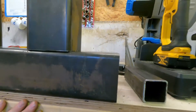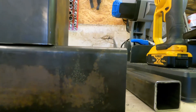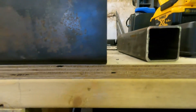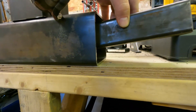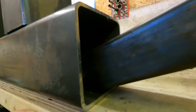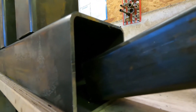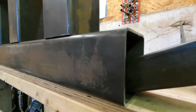What I'm thinking of doing is chamfering the corners off on this, and even opening up on the top — not to that line but somewhere — and the same on the bottom. What that'll do is I'll weld the plates on the inside for where this bushing's going, where the stabilizer leg's going to go, and that'll close that gap in there. It calls for 6mil plate to be used inside there, so closing it up 12mil inside plus the bushing — it won't be as much.